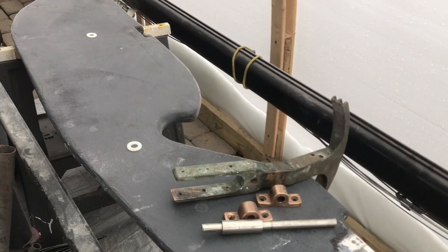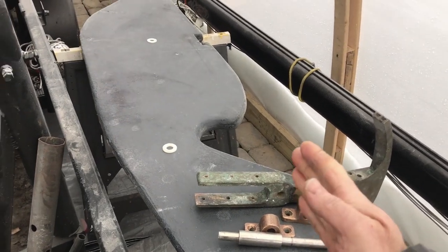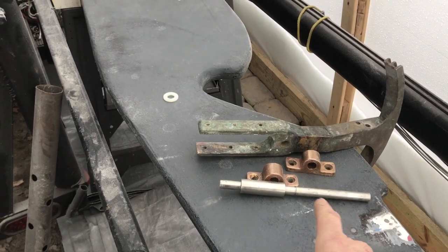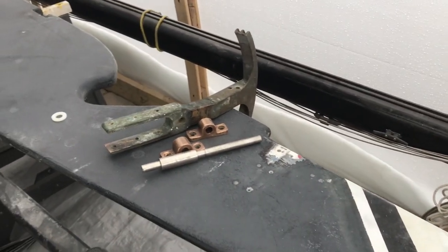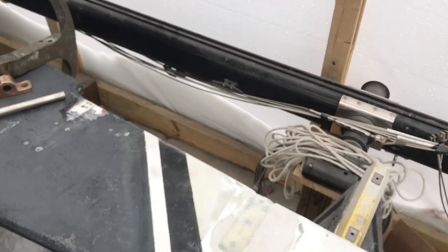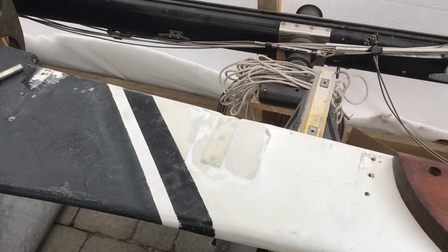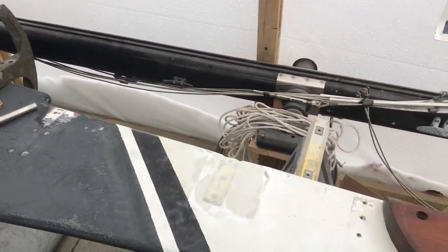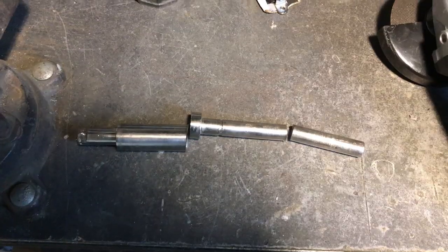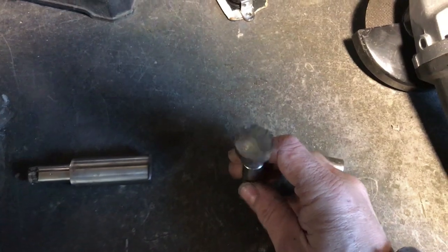I also mentioned that I might use the old rudder quadrant from the pedestal and just cut it and make a gudgeon out of it. I'll also use the hardware and maybe even the rod if I cut it. I'll probably do that. I also need to do some fairing here on the rudder from where the quadrant was attached, as well as the big hole that was left in the transom from that quadrant. I've also cut up the shaft into a perfect size pin for the gudgeon.